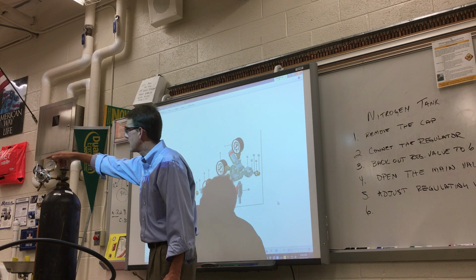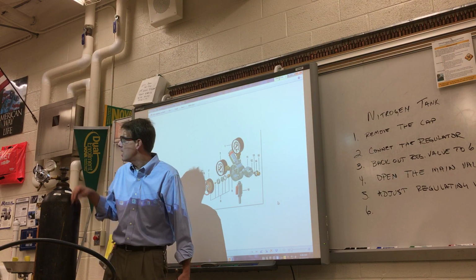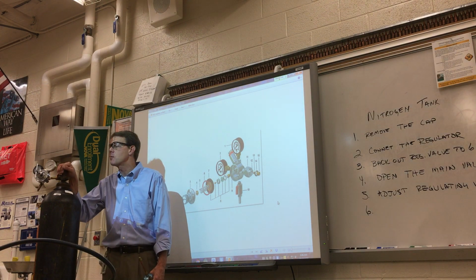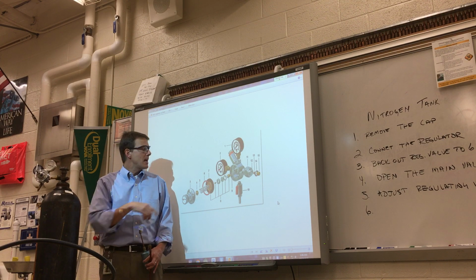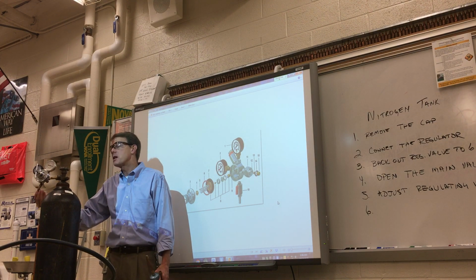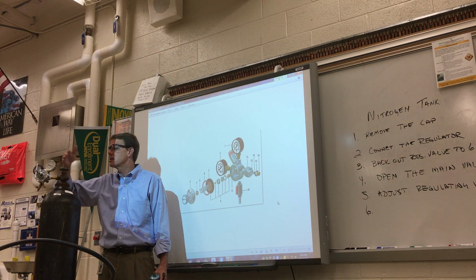It's under pressure. I've got pressure up against this diaphragm with the spring. If I turned it right back on real quick, some guys do, some guys just come right back up, leave the regulator set, and open it right up. You can pop that diaphragm. I've got all my pressure here again, but that diaphragm could blow in the center